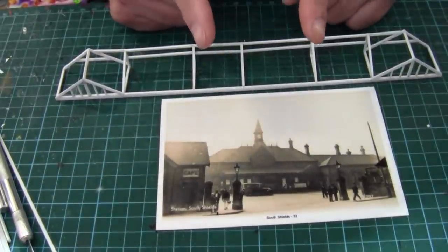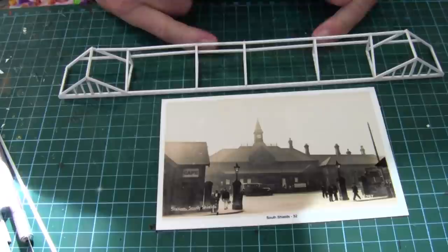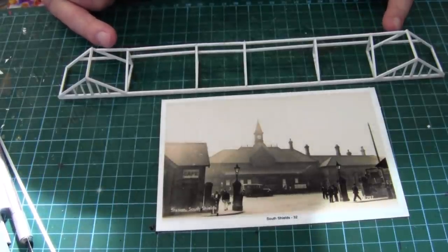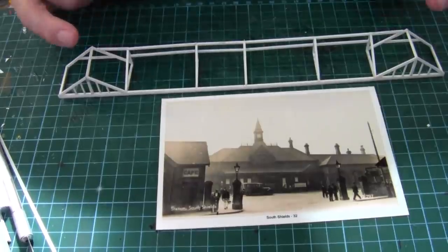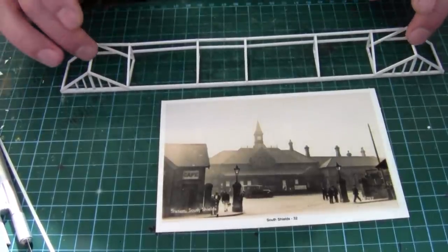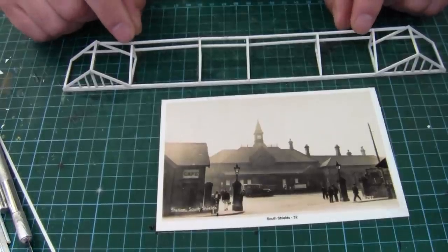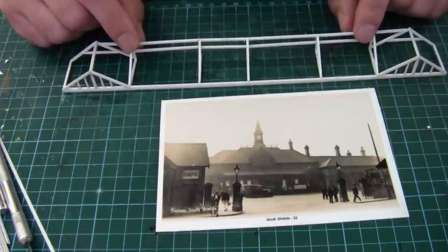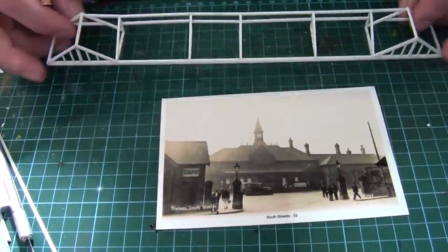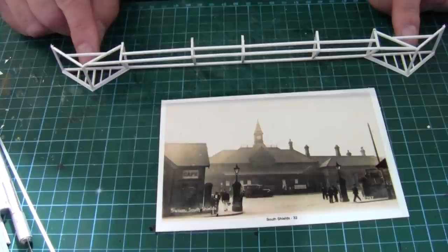So the reason why we're discussing the possibilities of glass and asphalt is if I put any LEDs into this, you're going to see the cables, that is for sure. Because I'd like to have at least two LEDs lighting up this canopy. One here and one here. So the only way I can see round it, looking at it again, is we have two crossbars here on the back. I can glue a little bit of plastic onto them with 3mm holes and have the LEDs here and here.